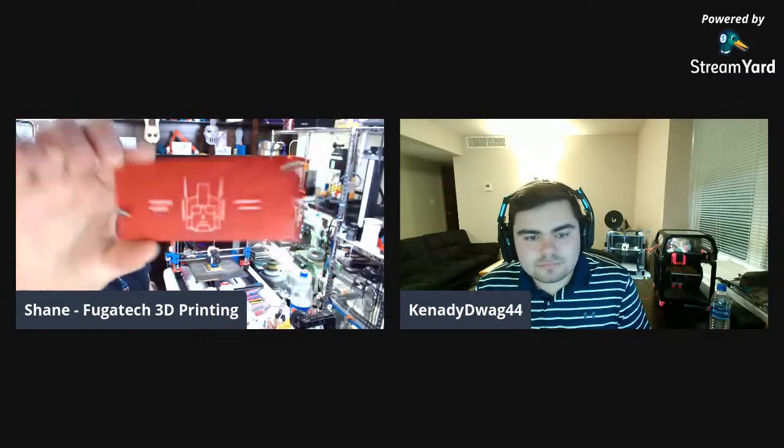Because also all the parts on here, all the multicolored parts, so the power supply, the logo, this part, the door to the board, I modified all of these, so I just put a backing on it. I just did a 1mm extrude as a new body in order to have the dual color and print it with a palette. I've not had a single failure with the machine. Now, granted, I'm not doing 4 and 5 day long multicolored prints because ain't nobody got time for that. But for all of my prints, which take up to, I'd say, a day, I have 0 issues with it.